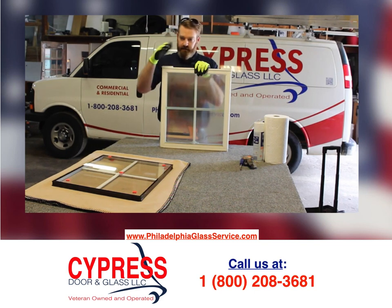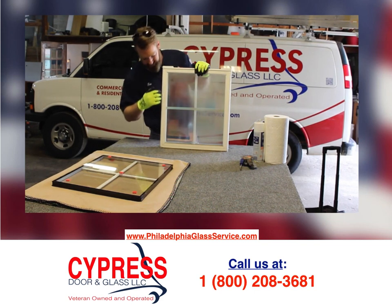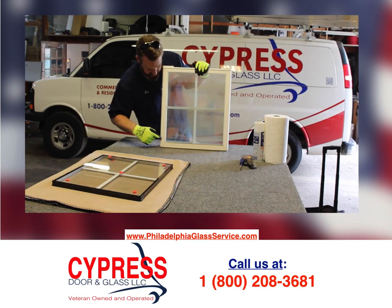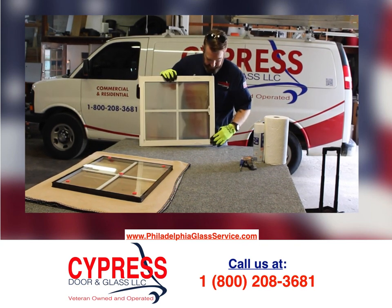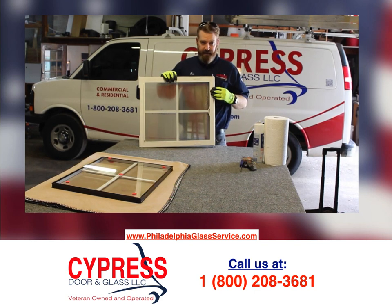You don't have to take your sash out or anything. You can look right at it and go to either side and see if it's got that seam right here, and you'll know that that's a glass stop. This side does not have the seam, so the glass is obviously not coming out this direction.